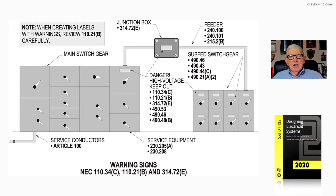Notice the conductors and conduit routed in that feeder going over to the subfed switchboard or switchgear. We would obtain those ampacities from the new Article 311 from a table dealing with the installation of those conductors. But the switchgear, switchboard, panelboards, and overcurrent protective devices you would naturally select from Article 490.